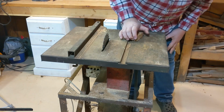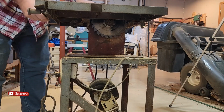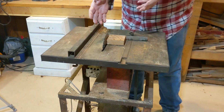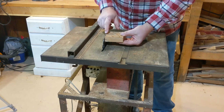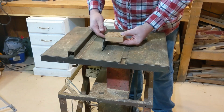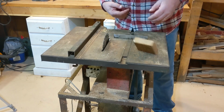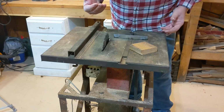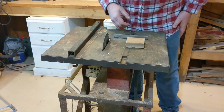So if you're cutting there, or if you're using the crosscut and cutting, your hand is right there, and it's huge. The safe way to cut is to make sure that this wood is just barely above, and then you only have this little bit sticking up to help you cut, and the sawdust that comes off gets mostly thrown down below. As it is here, if something happens and something touches this, it's coming back at me, right? So, two things: blade too high, causing amputation possibility, and throwing dust and debris at me, especially at my junk, you know, bad. Okay.